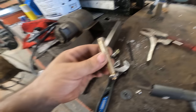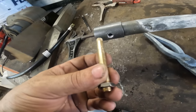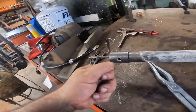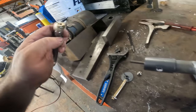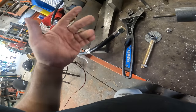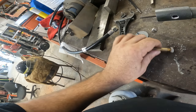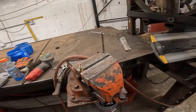This piece — the nozzle — is supposed to be in there. There's no way of orienting it without looking down in there; that's a dumb design. When I tighten this up, any movement just rotates it. We weren't getting a good stream down the tube, and when I went to adjust it, that piece got stuck in there. And then when I went to tighten it back up, it literally just pulled the threads out.